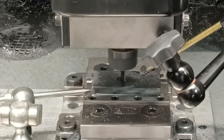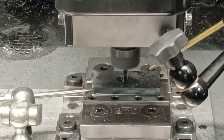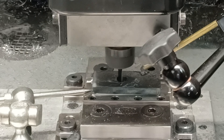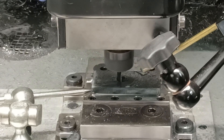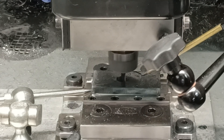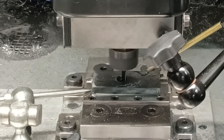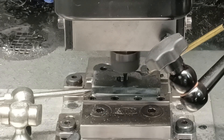And then there's a smaller hole. The reason I did this in two boring paths instead of one — if I did one, there would be a little tiny metal piece sticking up in the center, and at the very end when that breaks off it can damage your end mill. I've lost end mills that way. So if I'm doing a large hole like this with a small end mill, I will do two step-overs just to make sure I don't have the center uncut.